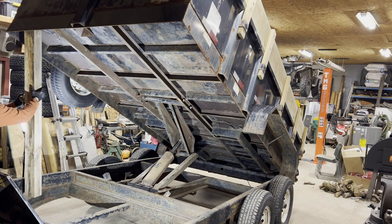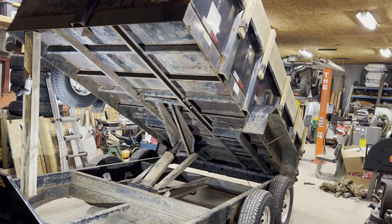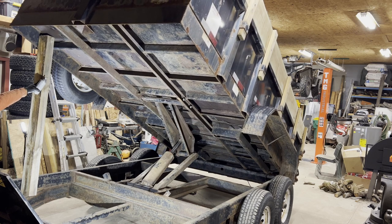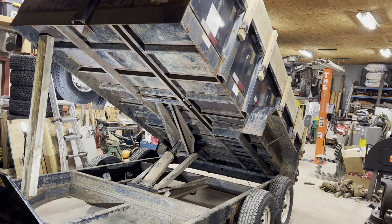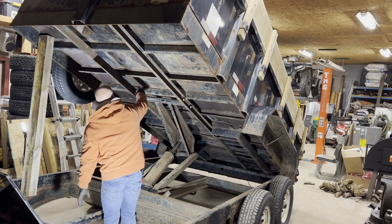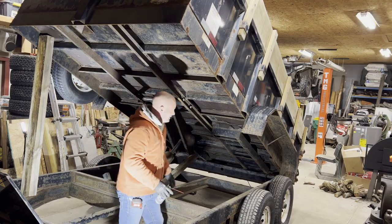There is a repair that was attempted, but there is now a bunch of goobered up weld that is stuck on the shaft and binding between the frame and the shaft itself. Thankfully the right-hand side is still in somewhat good condition at this time, so at least I can lift the trailer up and out of the way and I don't have to work on the ground, and can start looking at how the initial repair is going to be made.